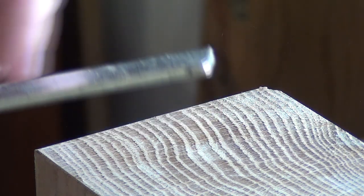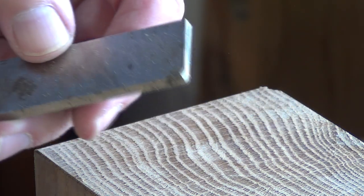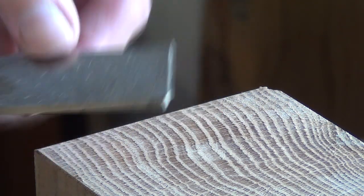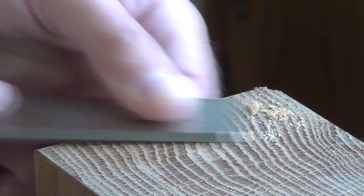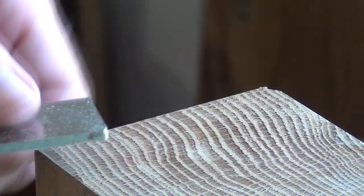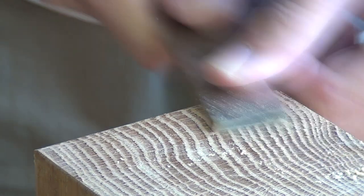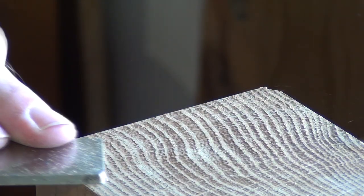You can make something a little bit bigger — either use a one inch chisel, or just a piece of tool steel with that edge prepared at 90 degrees. That's scraping tiny thin shavings off there, making a lovely finish. Work all the way around the piece. If you end up with any ridges from going in one direction, they'll get cleaned up as you work around to the other angle.